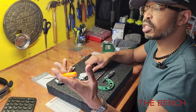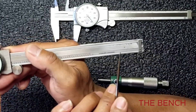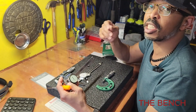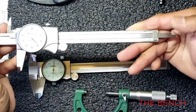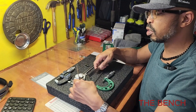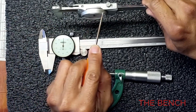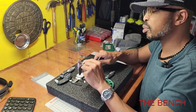As far as weight goes, the Insize does feel a little bit heavier. I also want to talk about the steel — I've been using these for approximately 13 years and you can notice a little bit of pitting. That is not a slight on Insize; I'm just a person whose hands cause metal to rust. The Mitutoyo also has a little bit of rusting and pitting, but not as much — they use a slightly higher quality of steel, which is what you'd expect from a more expensive brand. Another thing: on the face of the Insize dial there's a checkered pattern so you can rotate it easily, whereas the Mitutoyo has a smooth surface, which can get slippery if you have oil on your fingers in the shop. That checkered pattern is one thing I do like about the Insize.